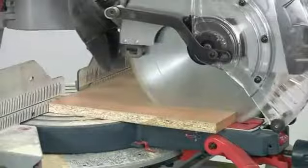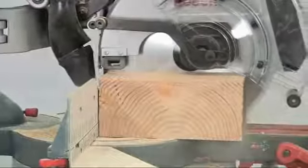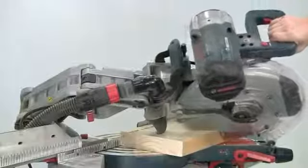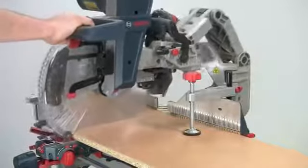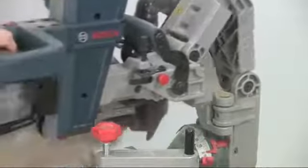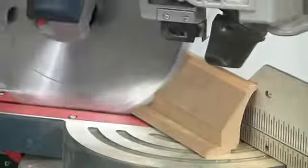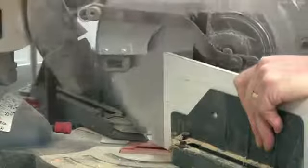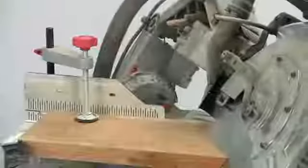The glide has one of the biggest cutting capacities on the market. The maximum straight cross cut is 341 millimetres even in material up to the maximum thickness of 104 millimetres deep. This reduces to a cross cut of 240 millimetres at 45 degree bevel and 45 degree mitre — that's some capacity. The rigidity of this axial glide mechanism is remarkable and even at full extension there's no hint of play on the arm. The impressive height capacity means you can cut material like crown moulding in the upright position, which is much easier. The design of the blade guide at the rear means you can cut deep thin material. The material clamp is another safety aid and it's particularly useful for compound mitre cuts where the timber needs to be held rigid.